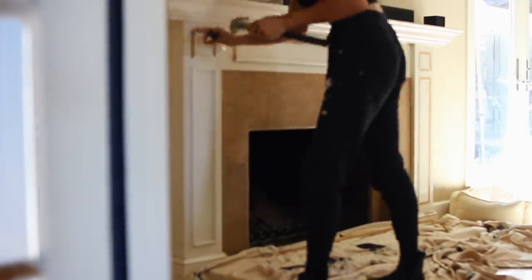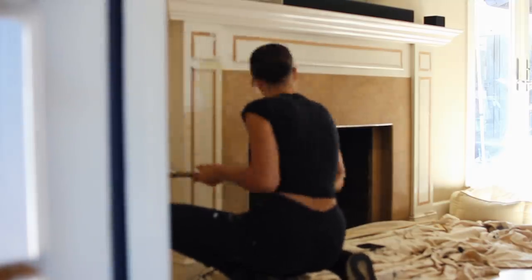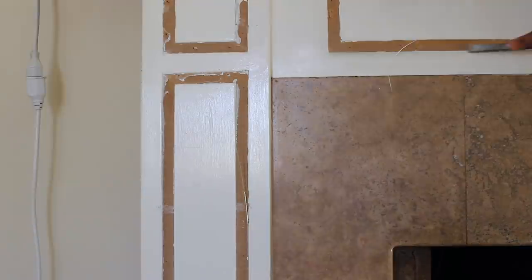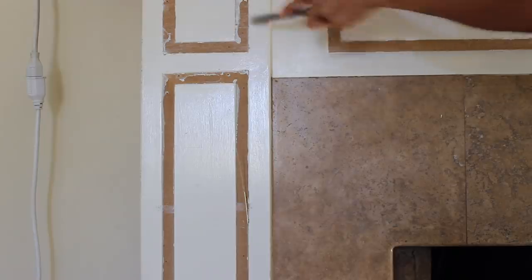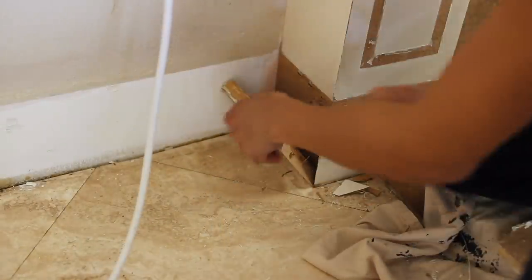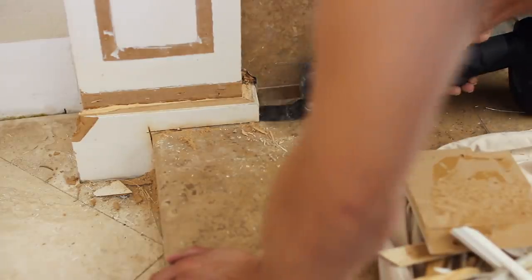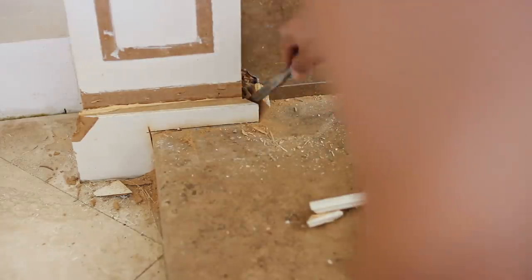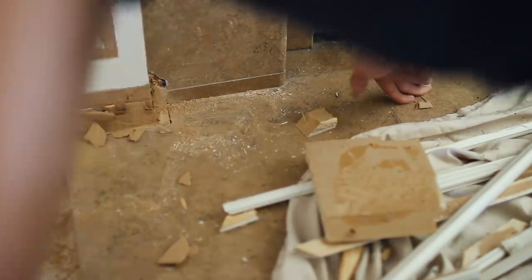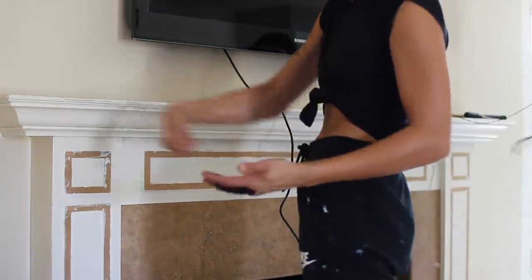I am really excited to be implementing the budget meetings with Holly because that is realistically what we do — we kind of break down design and then budget per that and execute what is realistic to the home since this isn't a forever home for her. I moved forward with removing anything that was going to cause the surface to not be smooth with the design we wanted to lay over it. That included nails, chiseling off any caulk that was there before, and I also decided to remove the baseboard since I'll replace those in phases as they are very tedious. It's always nice to have extra tools on hand — a chisel, hammer, pry bar, even a multi-tool. Wear your safety glasses, earbuds, and gloves when necessary, because I did have a little accident off camera: I slipped a box cutter and cut the webbing of my hand.